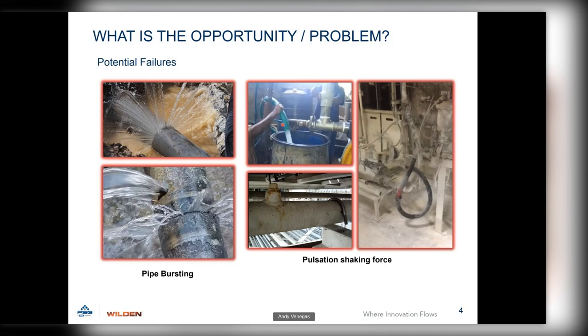On any facility plumbing, piping hangers are normally used. With constant pulsation — the shaking and rattling — it actually causes the U-bolts to come loose. The nuts come loose, the U-bolt comes off, and now the pipes throughout the whole facility start shaking, with that sound resonating everywhere. An easy remedy is to use a pulsation damper on the discharge of the pump. Similar flexible hose whipping action is commonly seen in typical applications.